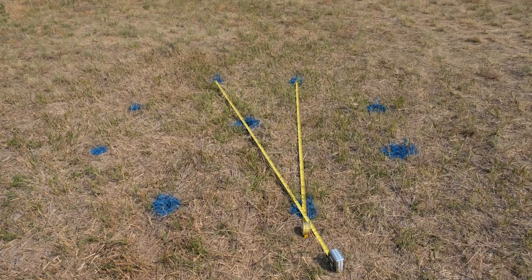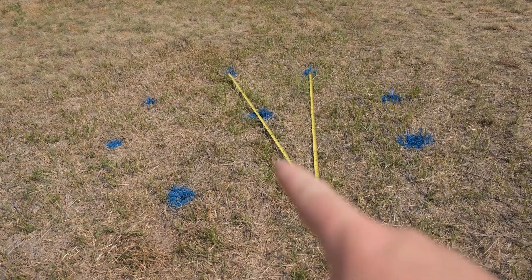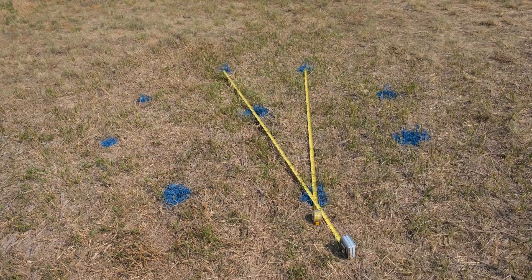That's relatively simple. I definitely recommend having two tape measures, a drawing that you can reference, and a second person to hold those tapes right at the center of those circles. Here's the finished product — all eight holes marked around the outside with the one pier hole in the middle. This is how you do that triangulation of the position, always using position one and two as your focus points and then triangulating to get each new position as you move around.